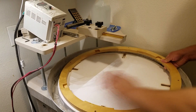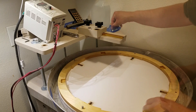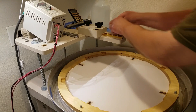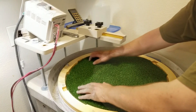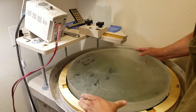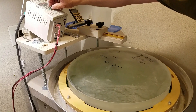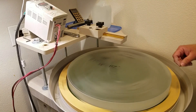Now the steel grinding tool is ready, so it's time to set up the fixed-post grinding machine for rough grinding. For every mirror size I make I have a wooden retainer ring to keep the mirror in place on the turntable. I used a CNC machine to make both the turntable and retaining ring with four perfectly aligned mounting holes, so when I bolt the ring down the mirror sits perfectly concentric. I add a piece of artificial turf about a half inch thick to cushion the mirror, and the mirror just drops in — nothing else holds it. The mirror blank is loose inside, so there are no binding points; it can move slightly, which helps avoid astigmatism during grinding.